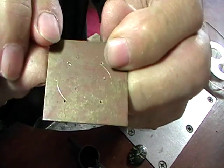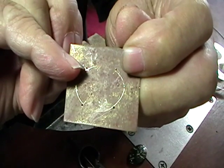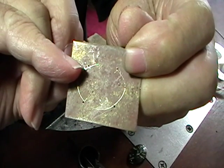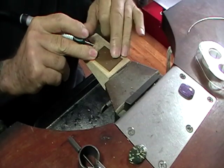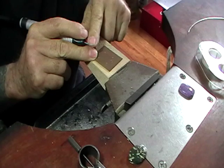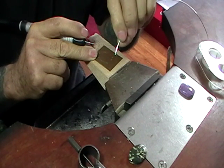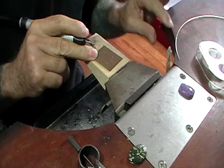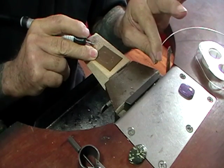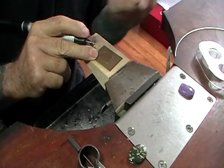When you've drilled your holes, the hole should be right on the line. Now we're going to drill through with the 1.2 millimeter drill bit, because it's the old putting-the-square-peg-in-the-round-hole problem. Even though this measures 1 millimeter, if you measure across the points it's actually 1.2 millimeters.